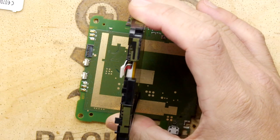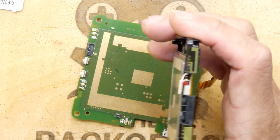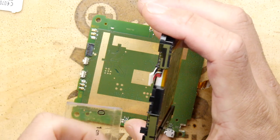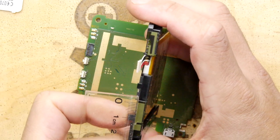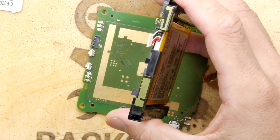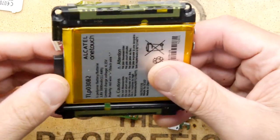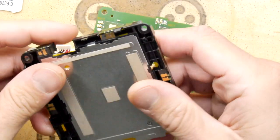And Wi-Fi is always diddy because it's 2.4 gigahertz, and sometimes, if you're making an antenna yourself, you can just sort of measure those. If you take a bit of coax and you just have a little bit of wire sticking out the end of the coax, if you keep it about a couple of centimetres, you'll probably get an okay signal.